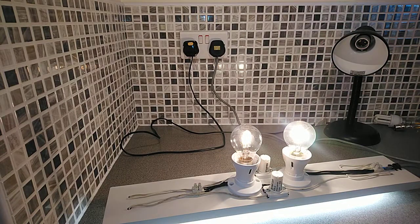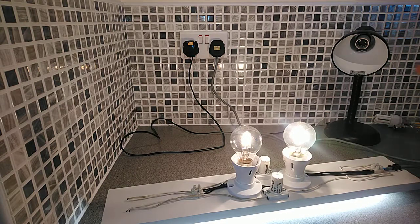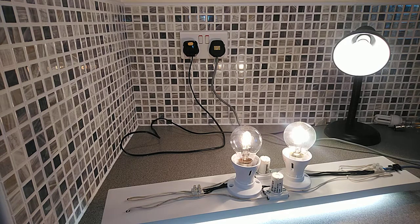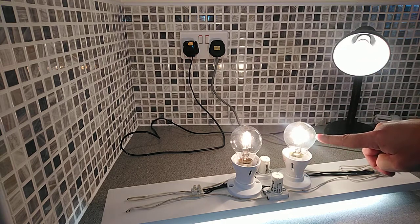That's come on straight away. As you're probably aware, people have done this before — the halogen lamps are in series with the fluorescent light. The power is going through the filament to the fluorescent light, to stop the fluorescent lights from burning out. You can also tell that this 40 watt light is brighter than this 70 watt.